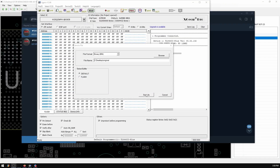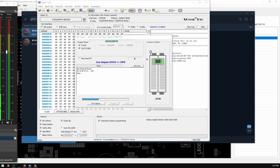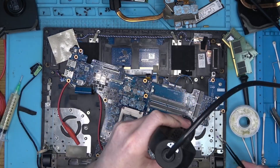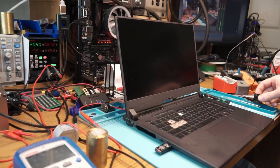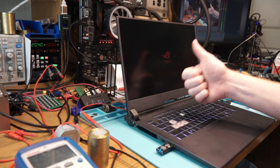At which point it is absolutely necessary to save the existing dump before flashing it with another one. So let's program the chip, solder it back to the board, power it up again, and see what it does. It posted. Incredible. Short is gone.